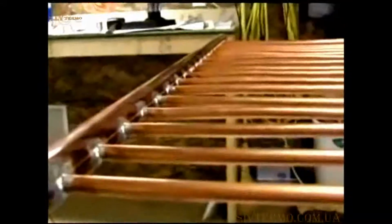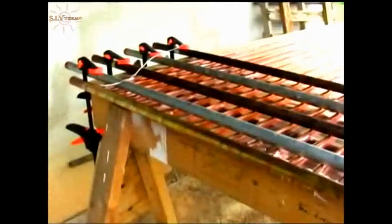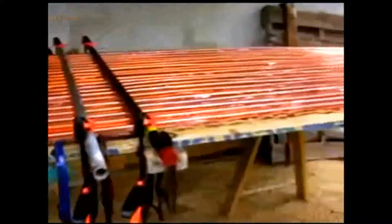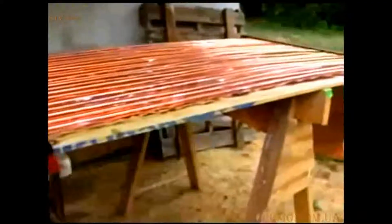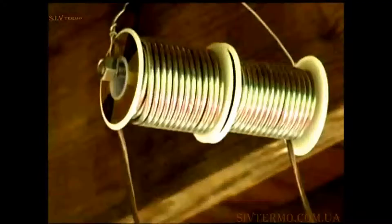Soldering headers indoors is okay, but the next step, soldering 5/1000 inch thick copper sheet to the copper tube, is best done outside due to the amount of smoke you will create. Press the copper sheet securely against the copper pipe. I have found 3/4 inch black iron pipe did a reasonable job. Have lots of solder available.